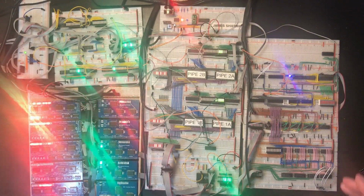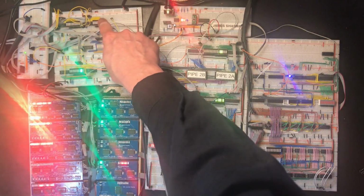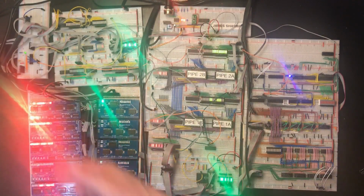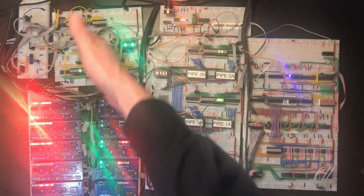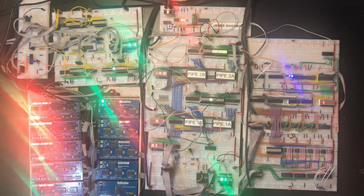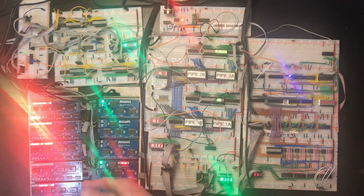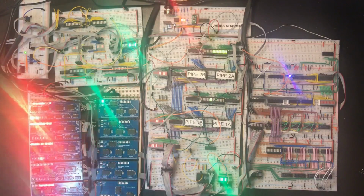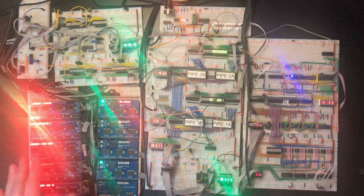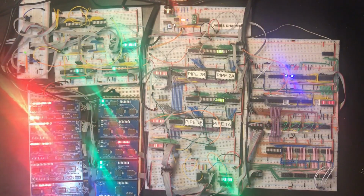I'm very happy. Next video on the CPU build, we're going to be actually implementing these back into the control unit, so then we can do the 16-bit moves. In theory, this is what we need to implement jump instructions as well, but that may well wait until we've got the transfer register, because at the moment the only way we'd have to construct a jump address is by incrementing and decrementing values. Although actually, yeah, we could guarantee that a register will be 0 and use it to jump back to the start, so we're not dealing with completely arbitrary 256 byte loops. So that's probably worth doing, actually.